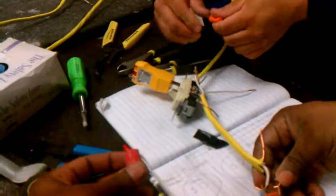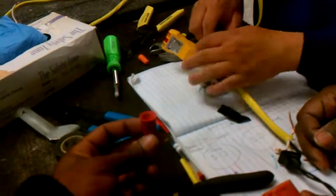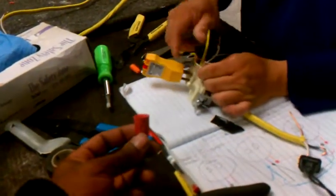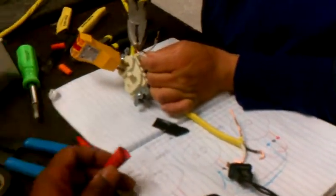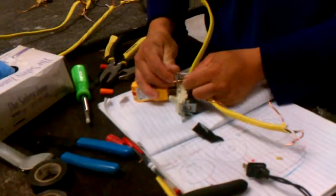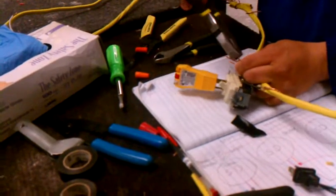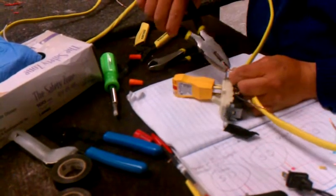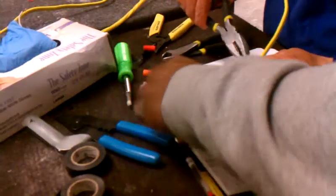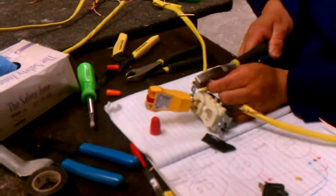I don't know if that's gonna work, but this will clean. A small one. That's orange. There's an orange one right there. So when we put a bridge, what is that bridge called? It takes all the neutrals together. What is that little bridge called? Is that a pigtail? Pigtail. Right, because we have an extra piece of wire bridging the stuff for us. Now you can do a pigtail, but only one wire, one screw. I see. You see, I'm just saying sloppy work real quick. Okay.